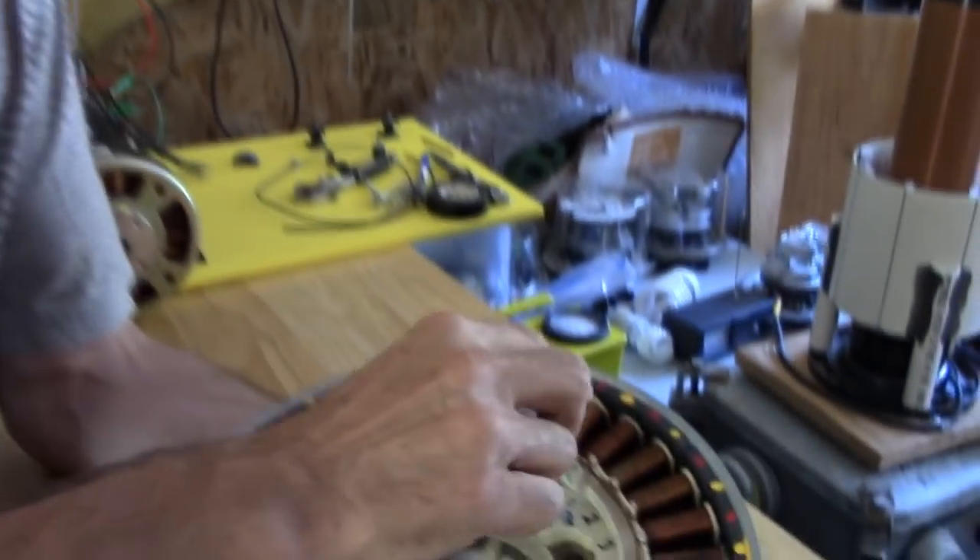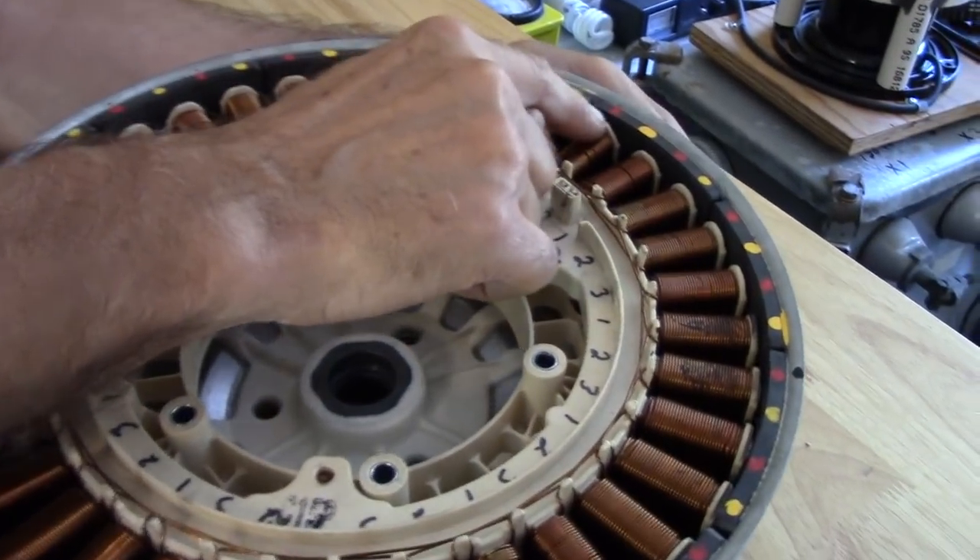Those motors have to run with volts, not amps. You probably need about an amp and a half to two amps for maximum torque, but current without voltage pressure behind it is worth nothing — you'll just eat current. If you have voltage pressure with a little bit of current, you will do twenty times what current alone can do.